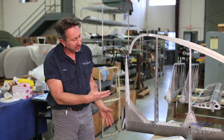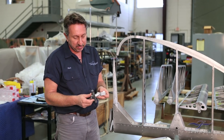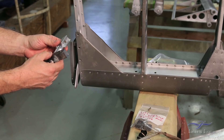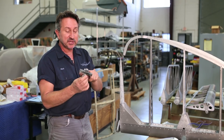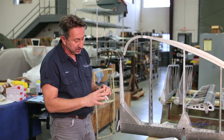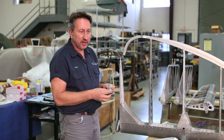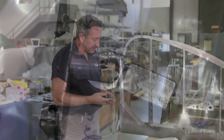One of the other things we found is that everything that connects the control surface to the airplane uses these series of blocks and bearings. This is actually the piece that attaches on the bottom of the rudder — it fits in here like that and attaches it to the rest of the airplane. I pulled these out because they were just covered in paint, dope, and dirt — totally unrecognizable, totally black. It's a magnesium block, aluminum fitting, and then a bearing. This bearing block is held in with a rivet, so we can't actually take that apart, but it's all in good shape. A really nice piece — beautiful engineering by the Germans. This piece is actually interesting because it was shared with the BF-109: while all the other parts are stamped 108, this particular part has 109 stamped on it, so it must have been a shared part used on the fighter that the Germans built at the same time.